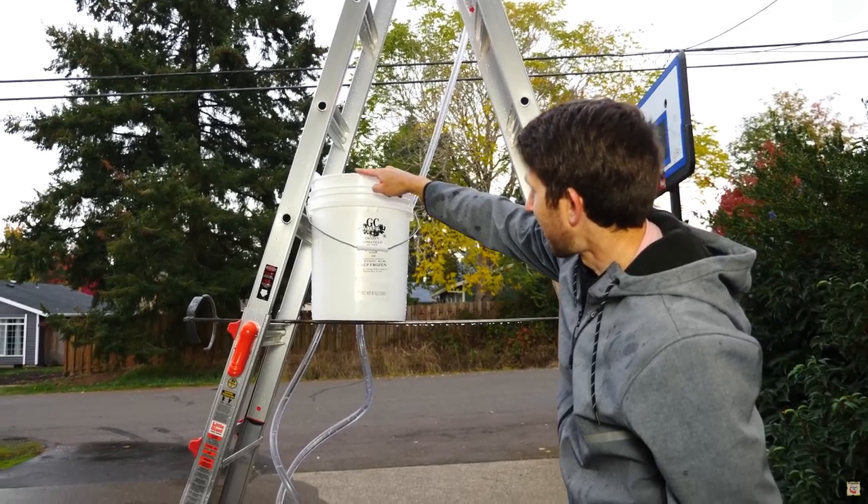In this case, we use the momentum of water to give it a little bit more potential energy than it had to start with — we use the momentum of water to raise the water level a little bit. So let's say instead of trying to siphon out water, I just wanted to keep pumping water up really high in a tube. Well, I can use something called a hydraulic ram pump.